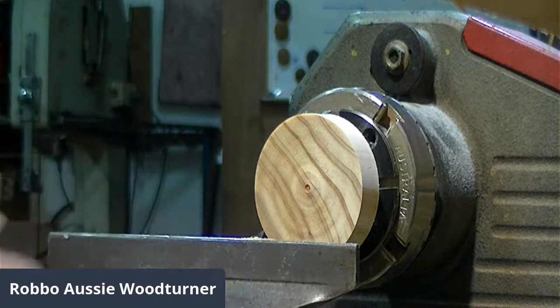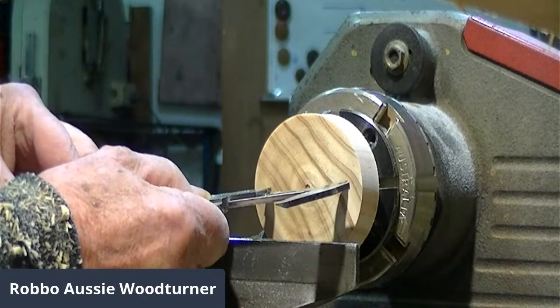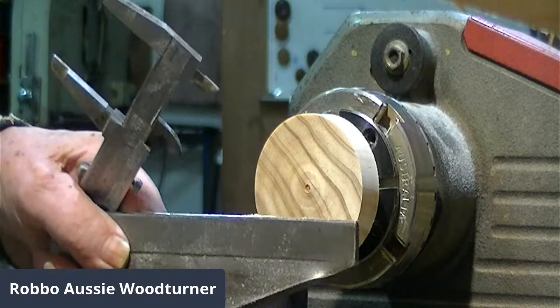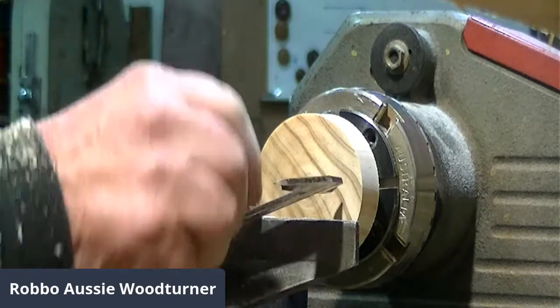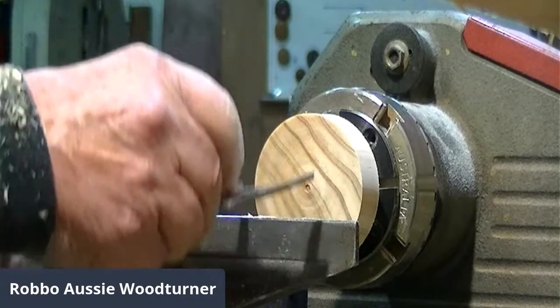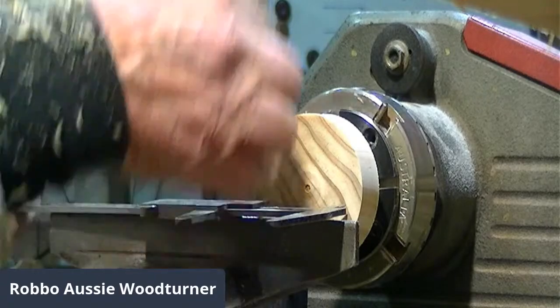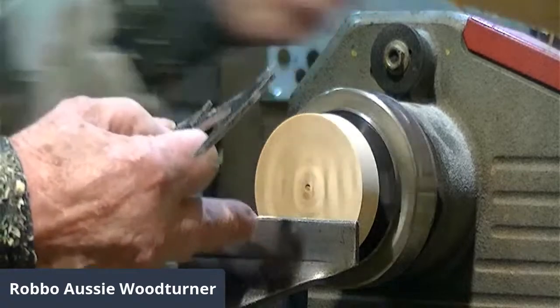Yeah, it's awesome. Okay. Now, set some verniers if you have them. What you're going to do is put a 50 mil ring around here. Now remember, whenever you're using vernier calipers, always keep this wing out back from the work, so you're only operating on the downward wing to get the size. And make sure that's on the center.